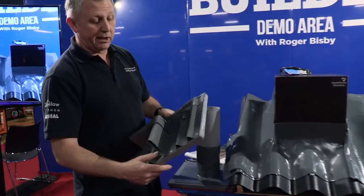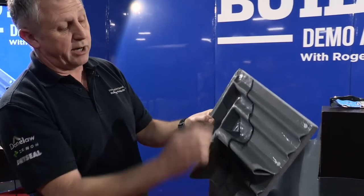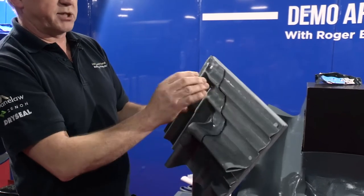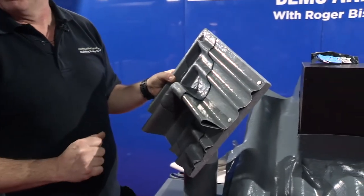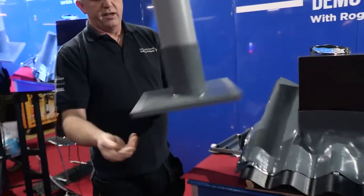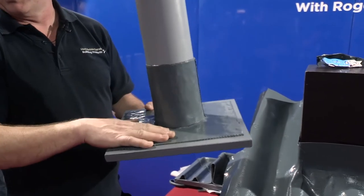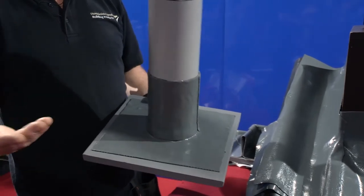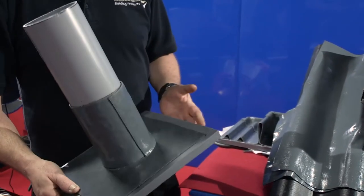Where it comes into its own as well — instead of having a great big piece of lead over the saddle, just a nice thin strip. You've got nearly 100mm there — that's totally watertight, 100% adhered to the fibreglass. After half an hour it starts to cure. And for the plumbers that are in here — I did that within about 10 minutes, fully adhered round the pipe, fully adhered on the roof. If you've got any scraps from it, save them — you can use that for repairs. Stick it on until you can get back and do the job properly. There's no wastage in this whatsoever.